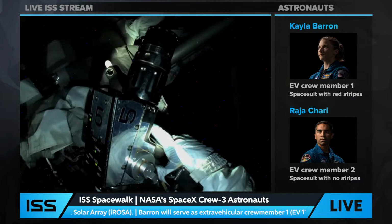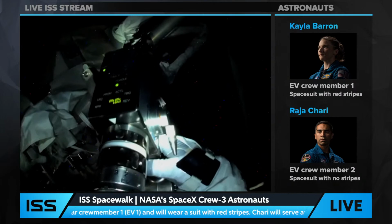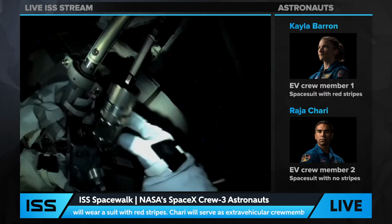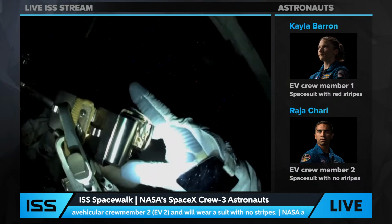And Ike, that was 6 turns on M30. Green light, torque is 25.4. M30 green light, 6 turns on M30. No issues. Okay, Kayla, we're going to ratchet again, ratchet clockwise, and verify MTL 30.5. Reminder, we have the 2-inch rigid socket if desired, and we're looking for 2 pops on M29 and M30.